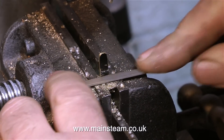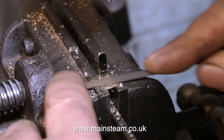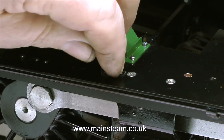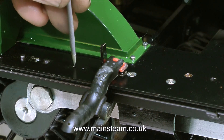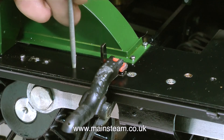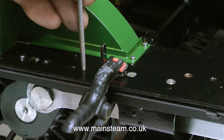There is enough material on the lugs that locate on the running boards to rivet them over during manufacture, but this wasn't done for whatever reason. There's definitely a problem with this particular bracket because the shaft that sticks out of the bottom of the bracket that goes into the running board can't go into the running board because the footstep is mounted immediately underneath it. After thoroughly degreasing the lamp brackets and cleaning out the holes in the running boards, I secured them using some Loctite 603, and the lamp brackets were temporarily held in place with a spring clamp until the Loctite cured.